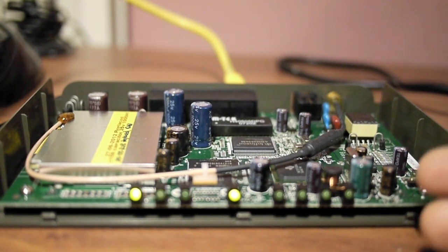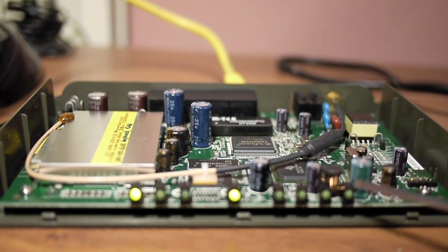If I wait 15 to 30 seconds, the ethernet light briefly flashes on. After one to two minutes it begins to flash more frequently, sometimes staying solid but more likely blinking continuously in a strange way. On the other side of the connection, it sometimes indicates the connection is half duplex when it should be full duplex, since this has a switching function of 100 megabits per second full duplex. If it drops to 10 megabits or half duplex, something is wrong. I tested the cable before determining the problem was in the switching part of the router itself.